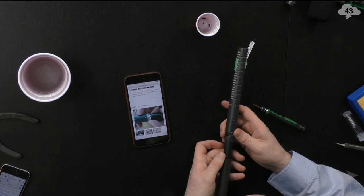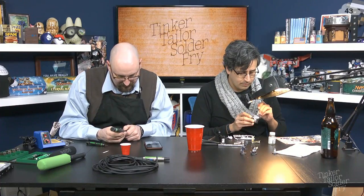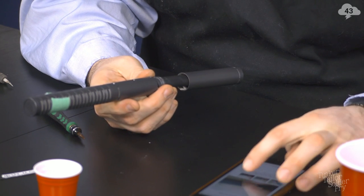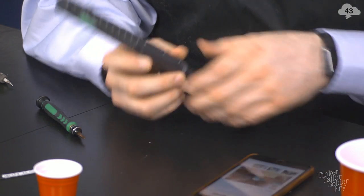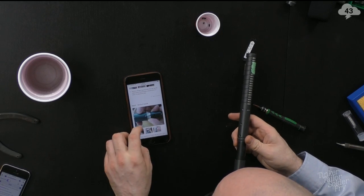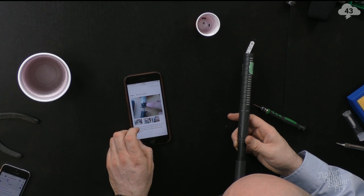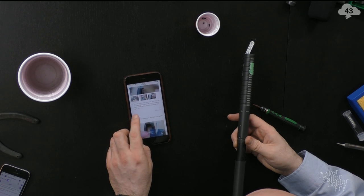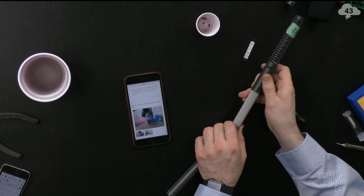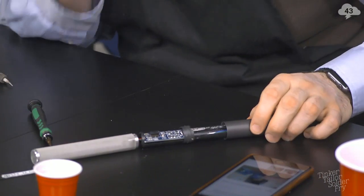All right, let's flip that around and have a look at the back side here. Identify the flange ring that holds the top capsule tube in place. Gently loosen and pull down in order to release the tube. Released. Okay. Then remove the capsule. Oh. Yeah, that's hanging on there pretty tight. Okay. Gently extricate the capsule and it will slide right out. So this comes. There we go. Now we know. So there's the capsule inside of which is all the microphoniness.